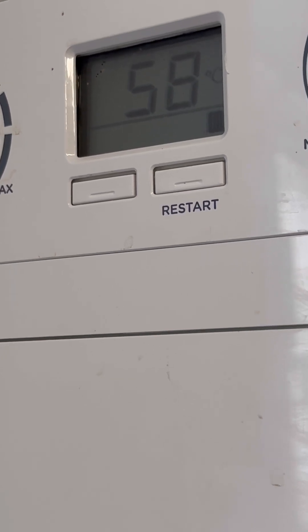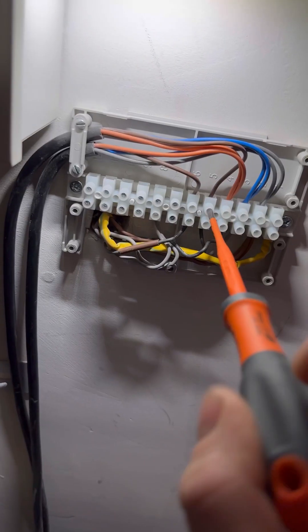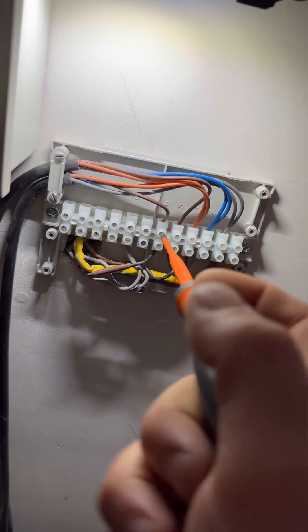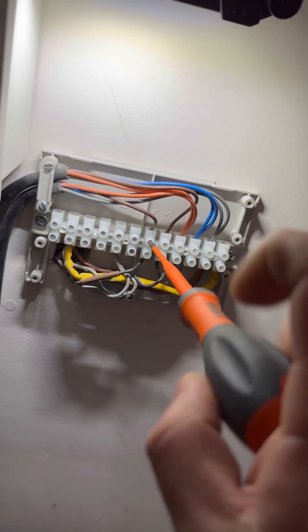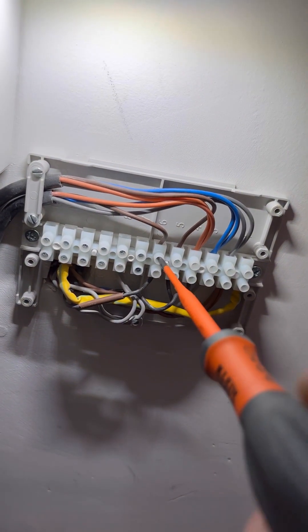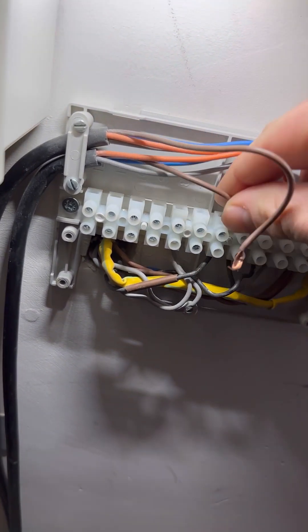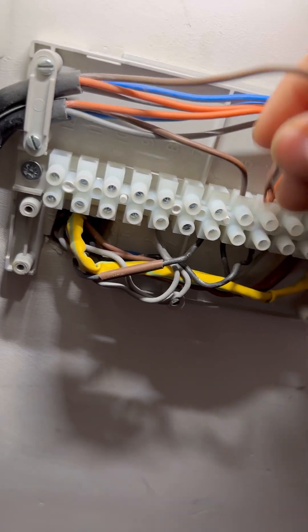I should have thought before, but we don't always think of the obvious. So I saw it circulating, felt the radiators - they were still cold. So I went back up to the 10-way and realised they've got these two zone valves wired up wrong. Rather than actually replace and move the zone valves around, just turn the power off and move the two cables so that they're wired up correctly to the right stats.